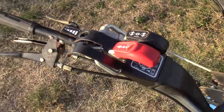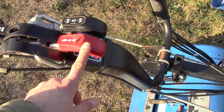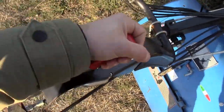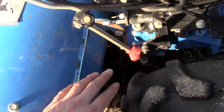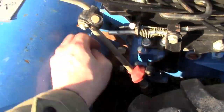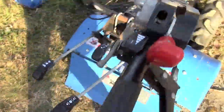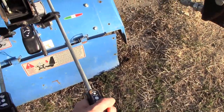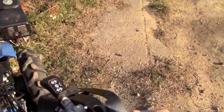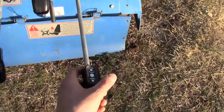You become a machine whisperer and figure out what these features can shine at. This is the reverse feature — you can drive it in reverse. One good part is when you engage the reverse lever, it will automatically push out the PTO lever, so power stops going to your implement. This is the PTO lever: if you want to engage the PTO and send power to a tool, you push it forward. You cannot physically push it forward when it's in reverse, because the reverse lever physically blocks it. So to engage the PTO, you put it back in forward operation and then push the PTO lever forward.